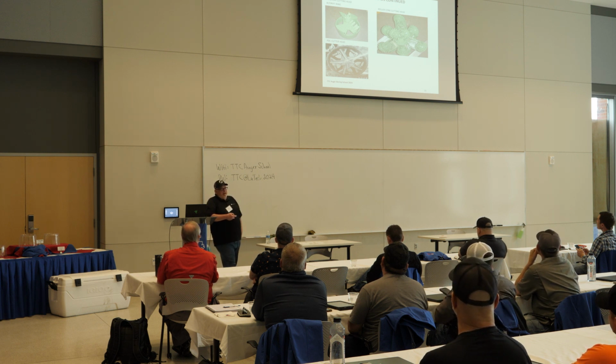We won't build them that big anymore, just because of the torque requirements. We spec'd out a 60 head one time, and they told us we needed 375,000 foot-pounds of torque at 60 RPM for that head to work properly. So we said, no, we're not going to build them that way.